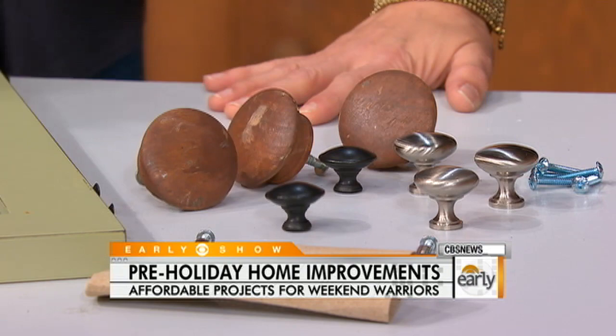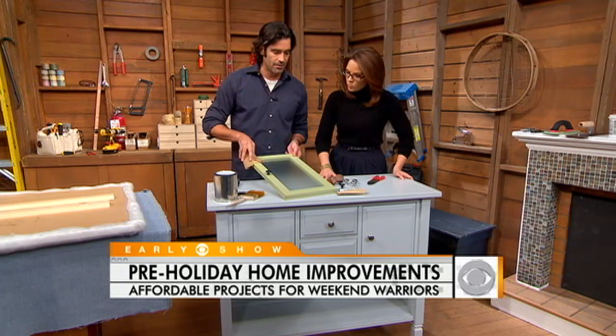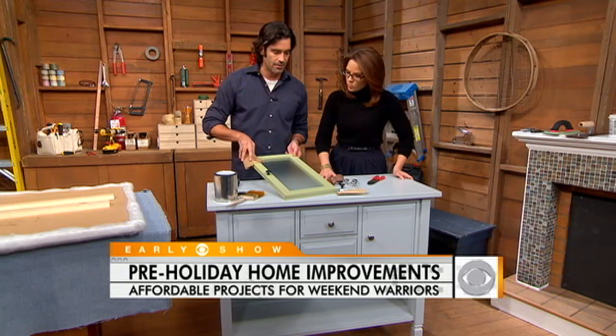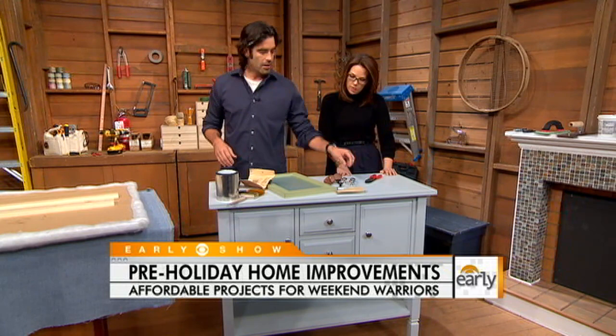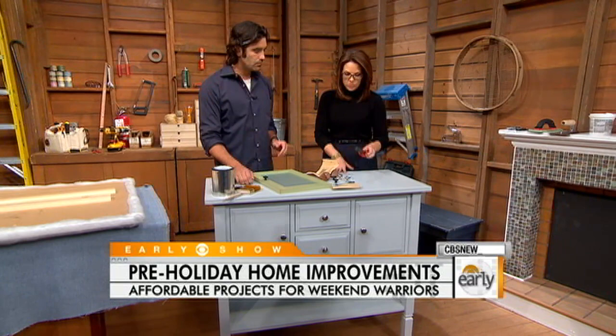First things first — choose your style: whether you want an old antique look, a satin finish, or a painted finish. Here you can see this was the original color of the hutch, and this green has a little distressing on the sides. First you want to take some 120-grit sandpaper and just sand it down to get that sheen off, then put some paint on. The finish you choose depends on where it's going and how glossy you want it. Make sure you match the screw holes when selecting hardware — for example, a drawer pull with two screws needs to match the existing holes.